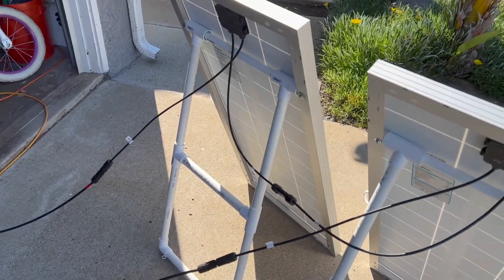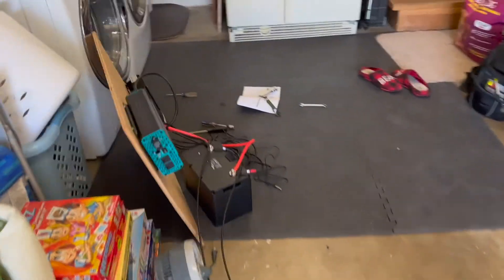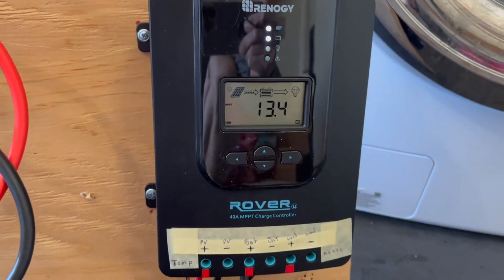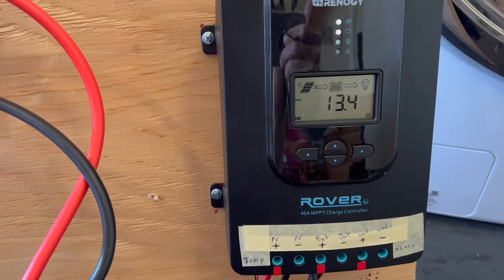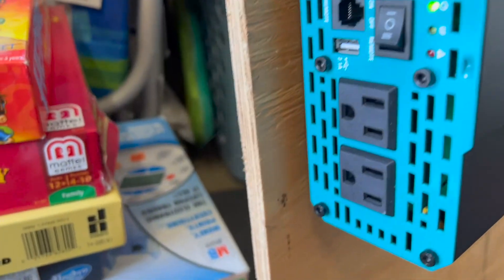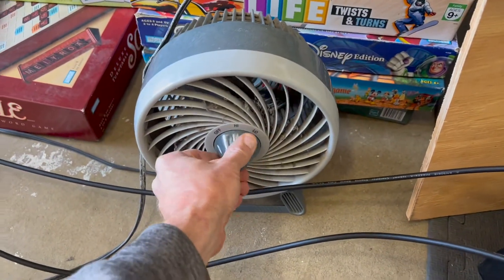I've got the 100-watt solar panels hooked up in series. That means I've got the positive and negative connected back here, so they can bring more voltage to the system — which is not recommended for a PWM charger, but since I have the MPPT it can handle the different volts and give the necessary amount to the battery. I also created these PVC pipe systems — I'll put a breakdown of what I did to make those on the back end of the video. The wires are going in the garage, so watch your step everybody. The charge controller is on, showing all the necessary system statuses. You can see the arrow has energy coming from the panel and it's back-filling with energy to the battery. Now I'm going to turn on the AC — that on button like we did before. Boom, and that's AC power. Good to go. All the indicators are good, just the green light, no issues with any kind of system problem. And then plug in this old fan and we got clean power.